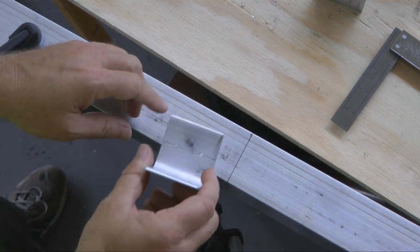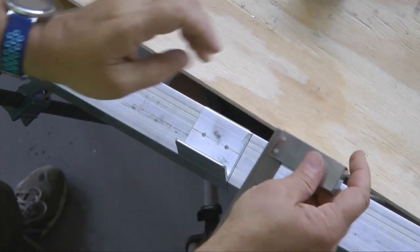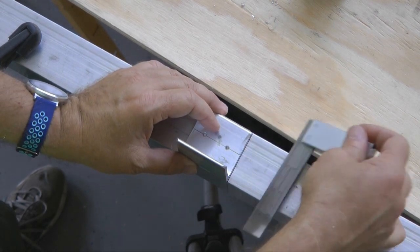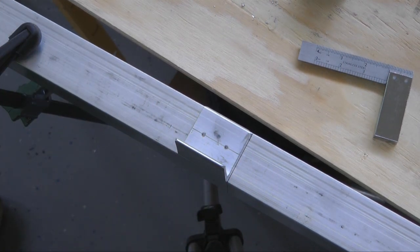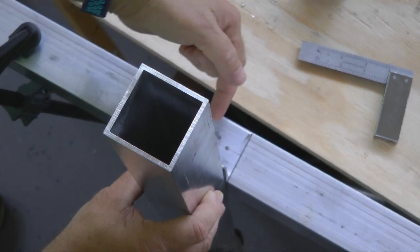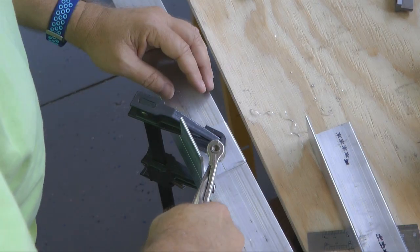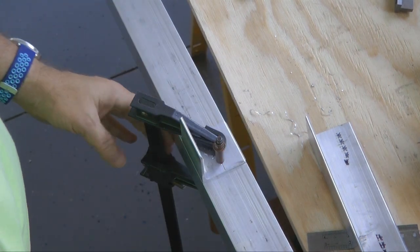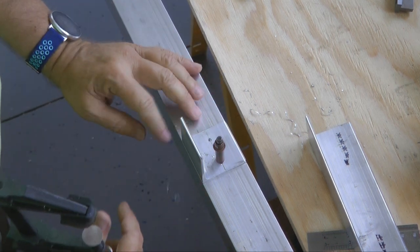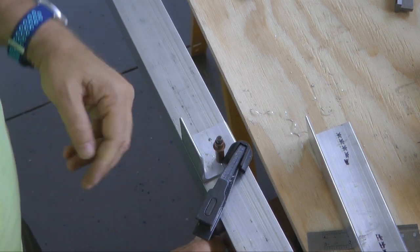And here's the location and the bracket we just drilled. So I'm going to make sure everything is nice and square and get my location just right. In fact, I will use a surface below to ensure that it's also in the right direction, perpendicular also. Got a cleco, and now we can drill the other side, and you can continue to use the clamp if you so desire.